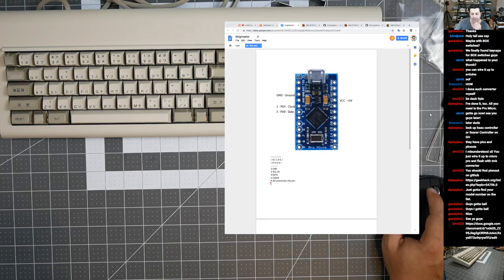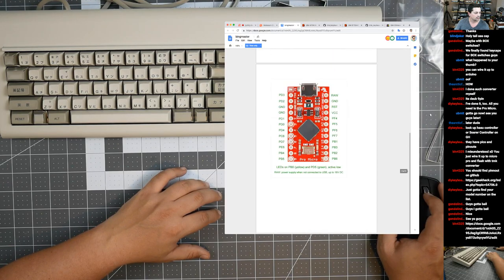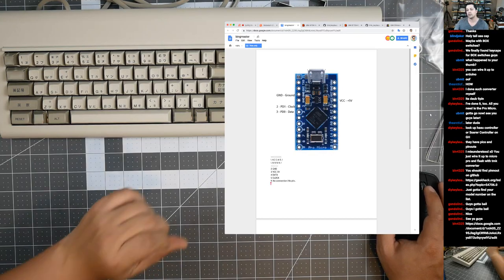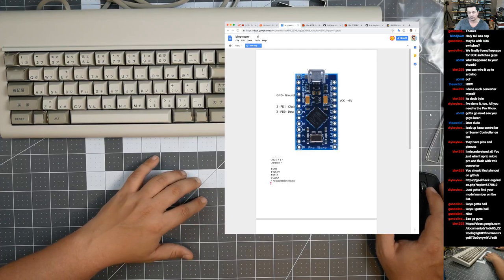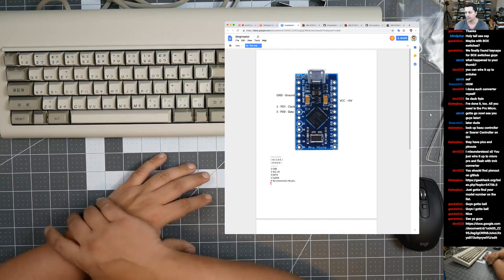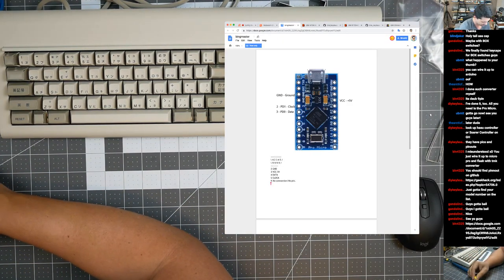I just did something very similar today, but I did a PS/2 keyboard emulator on Arduino. All right, so you have ground, clock. Yep. So you basically hook that up to the pins on the D9 connector, and then it will output to USB, right? That's very cool. Yeah, I'll try to do that today even. And then you just basically flash that to the TMK here, right? Which I'm used to doing.